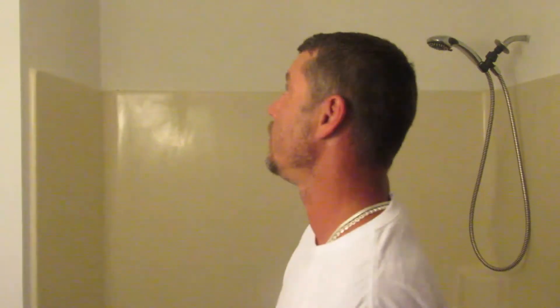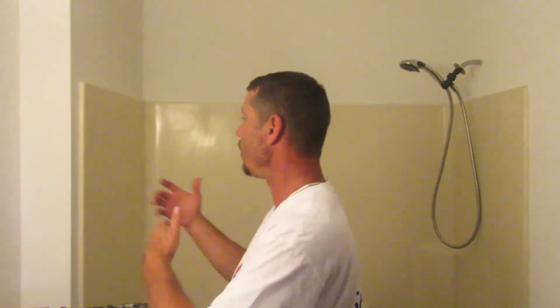You don't want flat ceilings in your bathroom because that's why you get the mold spots. That little bit of line is where I started painting. I'm going with eggshell personally because it's a low sheen, and then I'll do satin on my walls. I'm using Emerald products by Sherwin Williams and I'll show you guys that in part two. Hope you enjoy and I hope you like it.